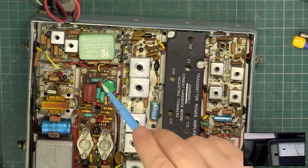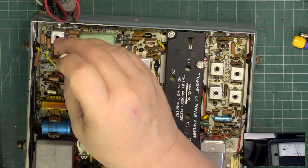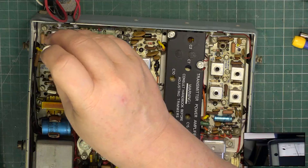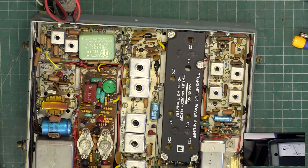It would be ideal to follow the manual for this. One of these is broken - I can show you this one - that one is broken. The fact that we can receive at all is remarkable. That's one microvolt. At the moment it's doing three microvolts for 12 dB SINAD. But it's not like that on AM - it doesn't mean that that's rubbish. If I go on the 0.3 scale, can I still hear it? The answer is yes - I can still hear it at 0.3 microvolt. The IF wasn't going to be that far out from where it's been before.